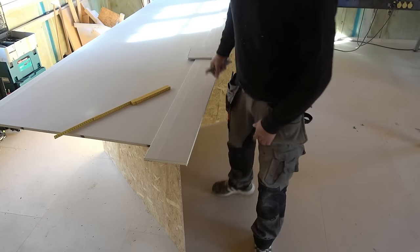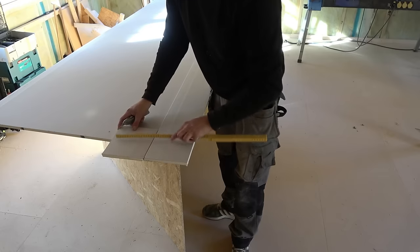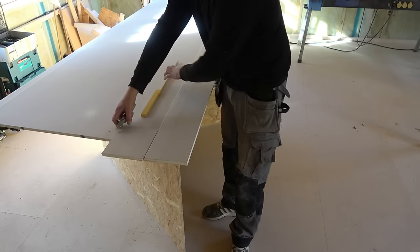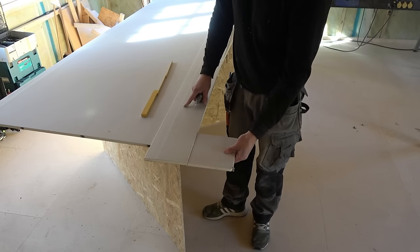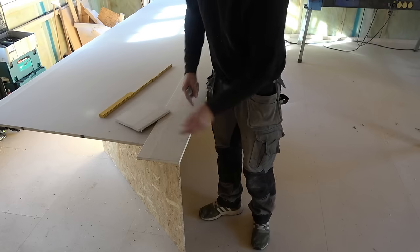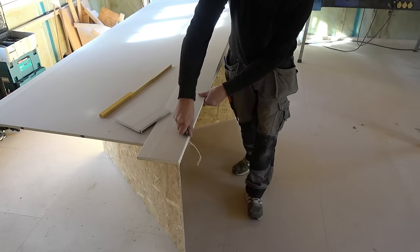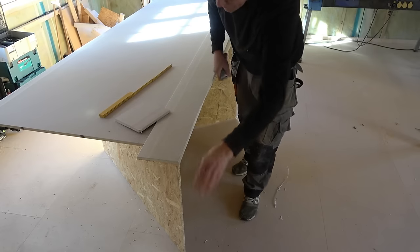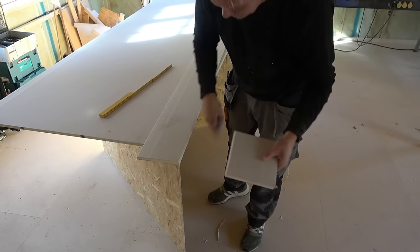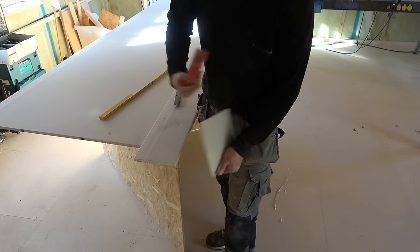After you cut the drywall, you may need to create a groove for putty. On the original edge of the plasterboard, it is not needed as the plasterboard already has a groove. But if two cut sides meet, we have to cut a groove for the painter. This may look simple, but it is hard to learn. You have to have the right angle, the right pressure on the thumb and the right speed. You can also trim the edges before that, it makes it easier.